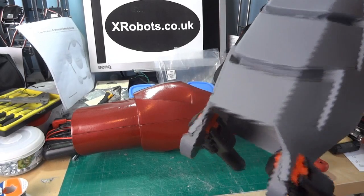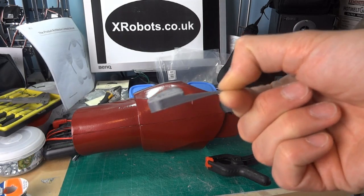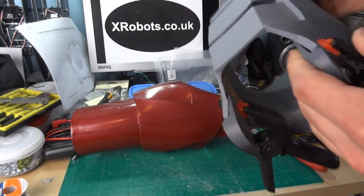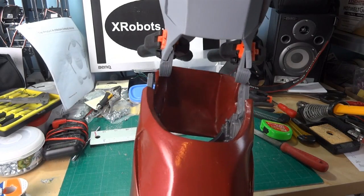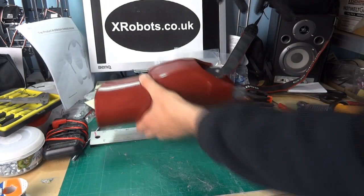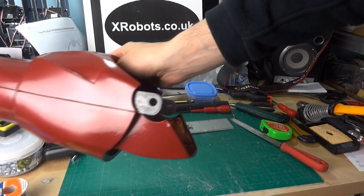So I've printed those parts and I've now attached them to the bicep as a test fit. So I've got a pair of them which are obviously opposites — just cleaned the top surface off with a file. We've got a couple of interesting angles there. They fit perfectly to the rather strange shape of the bottom of the bicep. So there's the pair of them, and that should align perfectly with the pieces I left in there. It looks pretty good. I basically need to paint this bicep up and then glue those in, and I've left pilot holes in them where I'm going to put a screw surrounded by washers which will fit exactly into there.